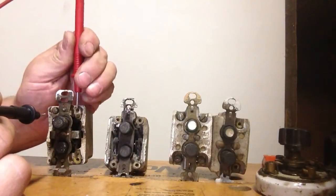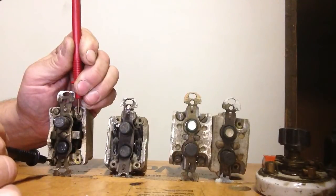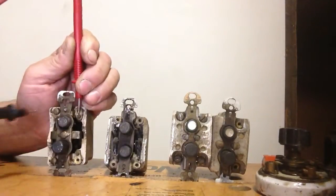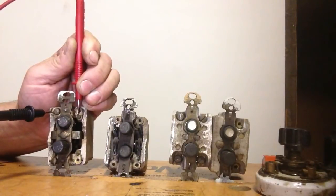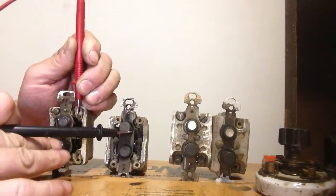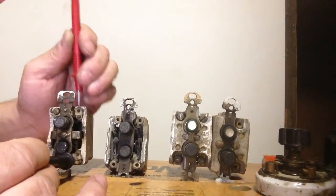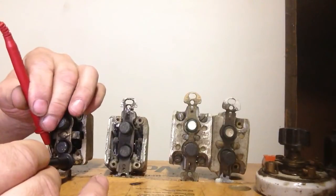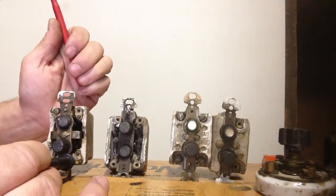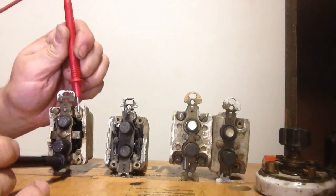Between this wire and here there's nothing. Here you have power, or a path, when you do your push button — it switches to this side and nothing down here. So these two wires are your switch wires. The button switches in between them. Now if your wire was hooked down here it's the same thing. So your switch wire is on this side, and your common wire would be one of these two on this side.